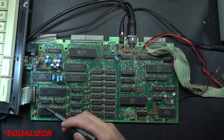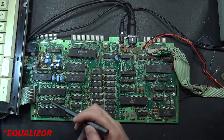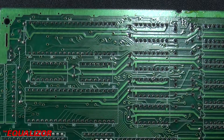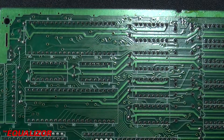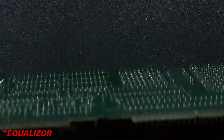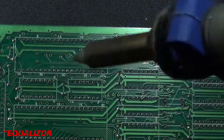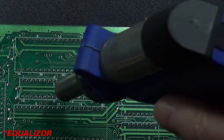That one is going to be the easiest to replace, so that is the first one I'm going to actually desolder. What I'll probably do is check it with my EPROM programmer, which can check logic chips. We'll check it with that and see if it passes. But first of all, we've got to desolder it, and to do that we're going to use our trusty ZD985 desoldering gun. So we're just going to check that this is the right one — we've got the 145, it's this chip here — and we're going to try not to break any tracks.